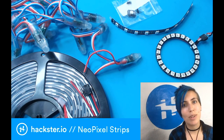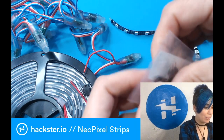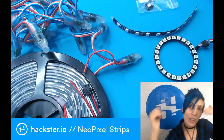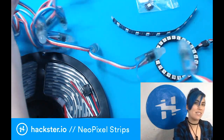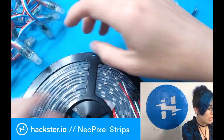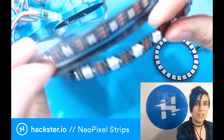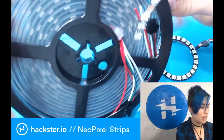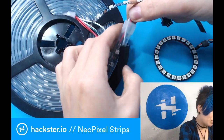I can't do a series on lighting without revisiting the topic of Neopixel LEDs. These come in single LEDs, strips, rings, matrices, flexi versions, and individual ones strung together — that last one is not an official Adafruit product but you can get it on Amazon. Just look for WS2812s or addressable RGB LEDs. They also come in strips with a flexible waterproof silicone coating that you can pull off, but it's sealed at the end so you can have a whole waterproof strip if you want.